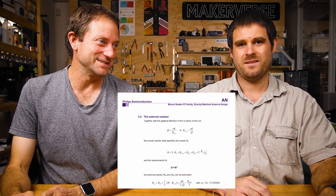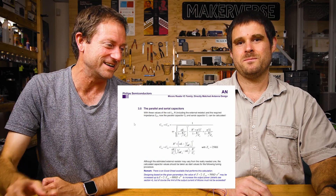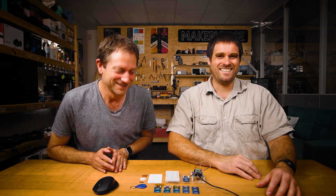So what's the actual design process for this matching circuit? We need some component values — how do we get them? Well, once you've actually measured your inductance of your coil, you go to the datasheet and look at all the formulas, start plugging in the values you know, put them into the formulas, calculate capacitor and inductor values — keeping in mind that you want your inductor to be more inductive than resistive, more inductive than capacitive, and to stay well below its resonant frequency. Then you just turn the handles on the maths, get some component values, and plonk them on the board.